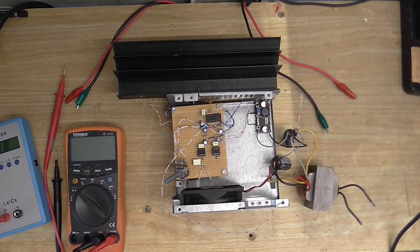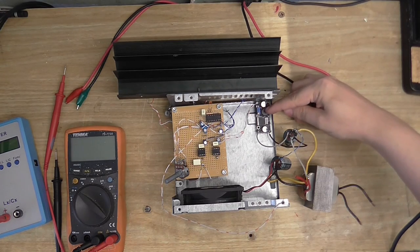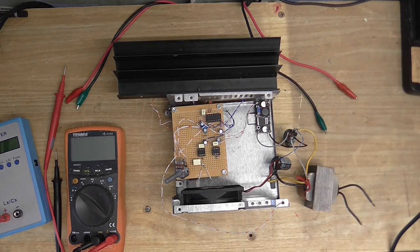And I've also decided to remove the voltage regulators because, as we found out earlier, I get a much better waveform closer to around 14 volts. So I put this little switch mode regulator in, and that's set to about 13.5. And well, let's just give this thing a little bit of a test. And then in the next video, I'm going to hook this up to a coil, and we should see some sparks.